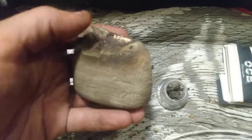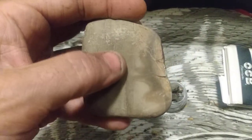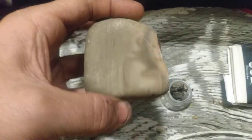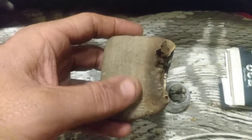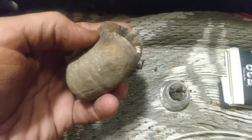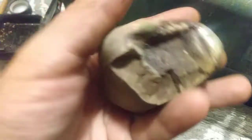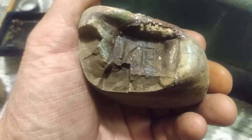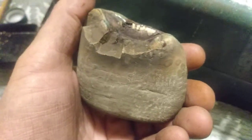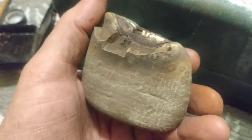I will cut this down and use it again, you might think, but the useful part of this is done. This stuff with all the layers won't absorb much. It'll be good heat shield though, and it'll be good for strictly a crucible, but that will not make a very good cupel. See, the whole point of a cupel is it's supposed to absorb the crap. Well, the proof is right here. It did a great job of absorbing crap. It absorbed a ton of crap. Then it shattered. Because as it absorbs crap, don't forget, it's pushing those molecules farther apart.